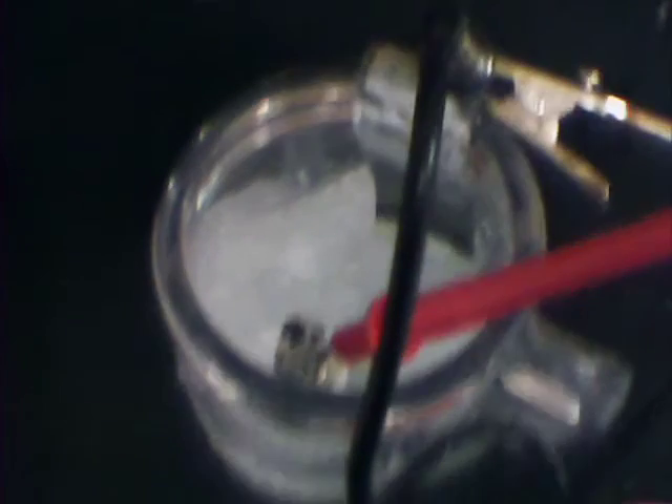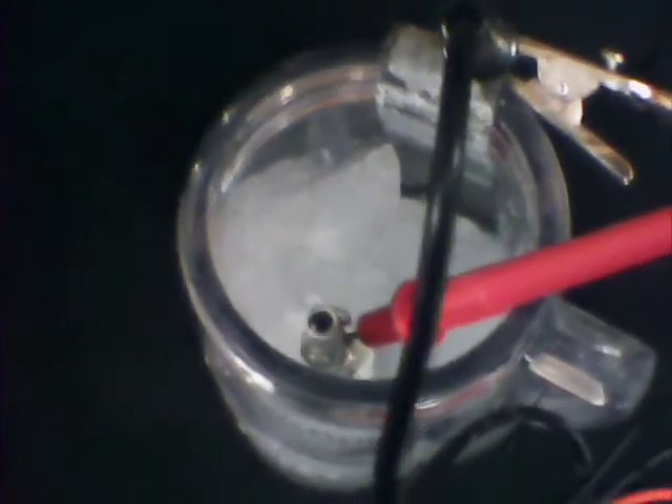Very interested in gels. I'm doing this, of course, like everybody else usually does, with one hand. Got it hooked up. Stainless steel is your cathode, and the zinc is your anode, of course. Now don't get excited — we've got 2.27 volts, but we're way, way far away from equilibrium. That'll drop down to 1.4, 1.5 volts. That's open voltage, of course.